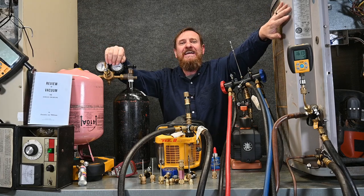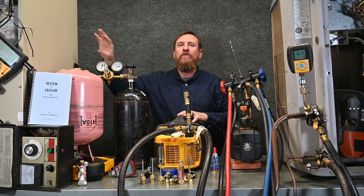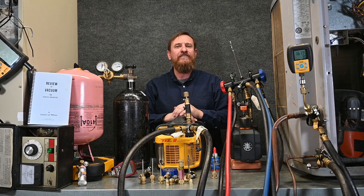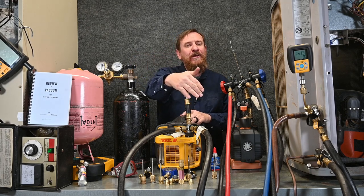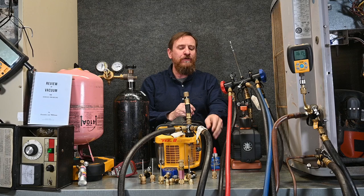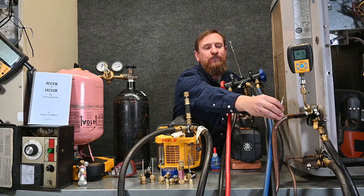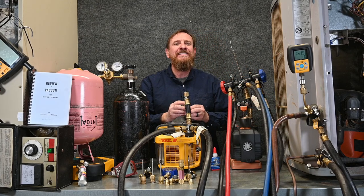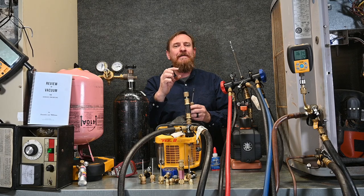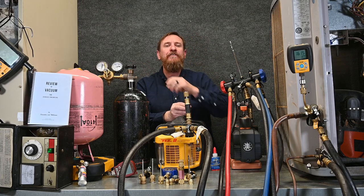We also want to measure and watch how much refrigerant we're putting in — use a scale to make sure we're seeing how much refrigerant we're adding, and put in just less than what the nameplate says. Every system is going to be different; just because the tag says a certain amount of refrigerant doesn't mean that's how much it needs. The line sets, what coil it's working with — there are several factors. After you get the system up and running, you can do superheat and subcooling to finish off your charge. Now we have positive pressure inside the lines, so we can add our Schrader cores back in — only when we have positive pressure. Don't try to put your Schrader cores back in while you're under a vacuum, because all of that air and contaminants and moisture will be sucked right into that system.